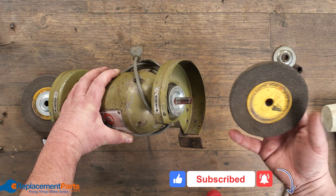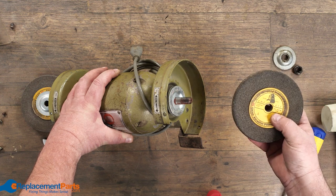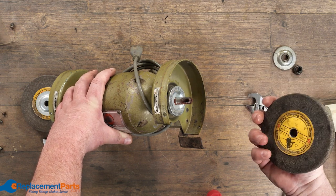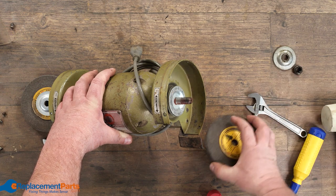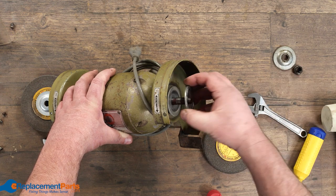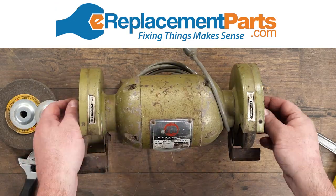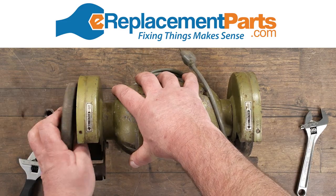The wheels themselves can actually be bought with bushings so you can fit different sizes. Some wheels, especially wire wheels, sometimes have a direction, and they always have a maximum speed, so you always have to double-check to make sure the wheel will work with your particular grinder and that you're not exceeding it. To put it all back together we're just going to reverse the process. Thanks for watching — if you have any comments or anything you'd like to see in future videos, please leave us a comment, otherwise we'll see you next video.